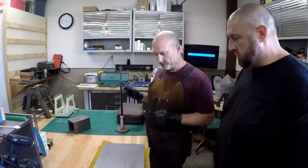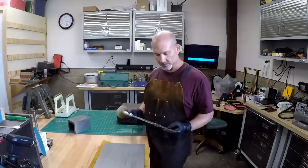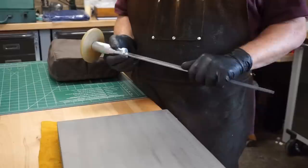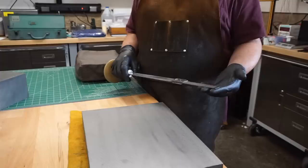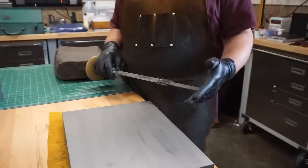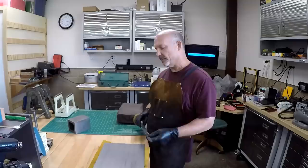Right. So something I wanted to cover again, I know I'm going to repeat a couple of things, Adam, but this is the basic setup that I started with. I read about it, and then Richard King reinforced it when I trained with him initially. For your own hand scraper, just buy a good carbide end. This is the 20 by 150, and it has the 60 millimeter radius on it. It's an all-around tool; 80 to 90% of what I've done in the last couple of years has been with just this setup. Obviously I've added a power scraper to it.